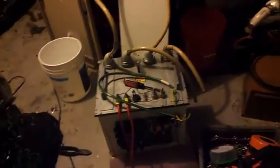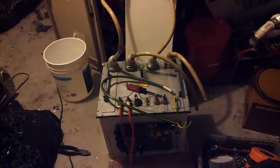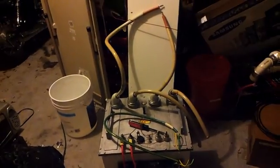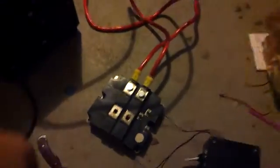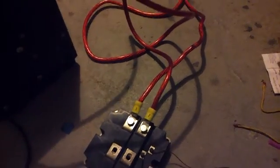Being as I don't have a safety gap set up yet, I didn't really want to push the limits of the secondary sparks. There haven't been any modifications to this transformer except that I've taken out the current-limiting resistors on the secondary side. There was a set of 480 ohm resistors — one of them was actually cracked in half, which is why this was most likely decommissioned in the first place. The IGBT would normally have a heat sink on it, but being that we're running on such a low voltage it doesn't get noticeably warm at the frequencies we're running it at.